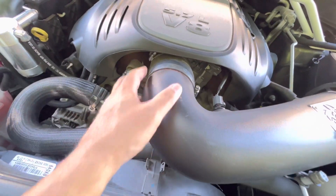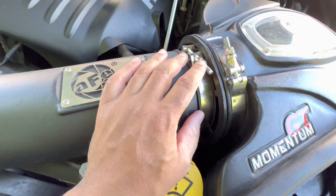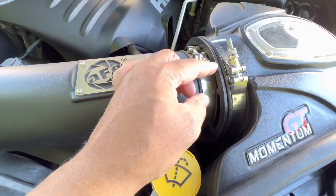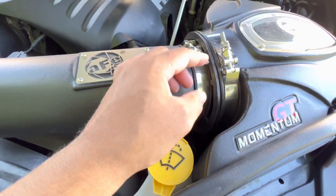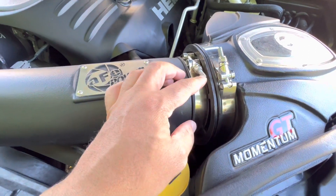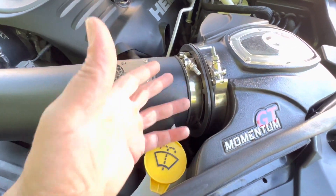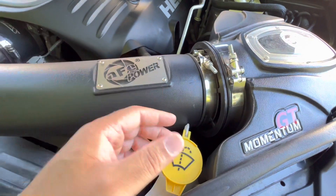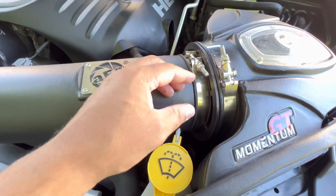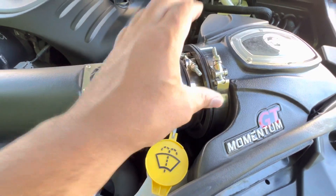To remedy that, we took our offset coupler and put that on. What is also key was these nuts and bolts, these two clamps — I ended up snipping and cutting them down to about one inch. This bolt was actually sticking out about four inches. With a deep socket you can only snug it down so tight, and when it's not tight, obviously it's going to shimmy out of place even more. So I cut this bolt down to about one inch, got a deep socket, and was able to snug these down really, really tight so that this thing hasn't moved.